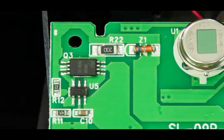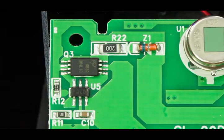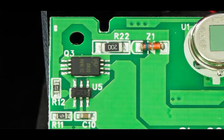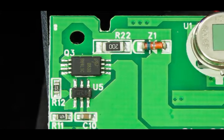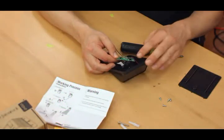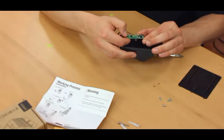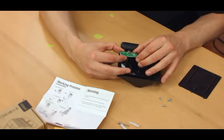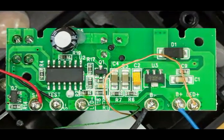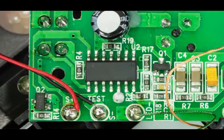The circuitry is fairly simple, with notable components on the front being the passive infrared sensor, the power button, an 8-pin chip, and a 6-pin chip. There are the usual sorts of support components — resistors, capacitors, and even a zener diode — and what may be a voltage regulator or transistor labeled X03V15. An internet search didn't turn up anything on it. For your reference, the 8-pin chip is labeled 8830BV4L1C, but again, that didn't turn up any info on Google. Just based on how it's wired, I'm going to take a guess that it governs the charging of the lithium cell — setting charge current and voltage and providing overcharge and over-discharge protection. The 6-pin chip may be a voltage regulator involved in the charging. Around the back of the board is more support componentry and what is probably the mastermind of the whole operation: an unlabeled 14-pin chip. I'm guessing it's some kind of microcontroller, but beyond that, it'll remain a mystery for now.